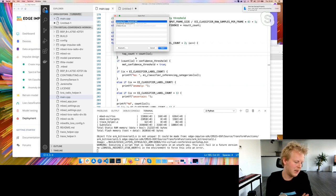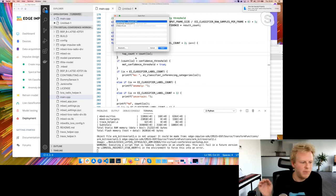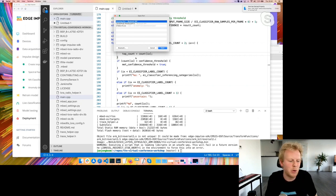We do about 1 second of analysis in 10 milliseconds. So for the 4 seconds of data, the 20 frames or so, it takes 200 milliseconds out of the 4 seconds. So this is much better in real time. And we can do this for audio as well. Even on this tiny little dev board, we can do real-time audio processing.